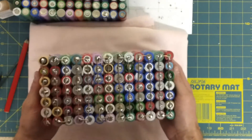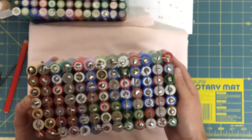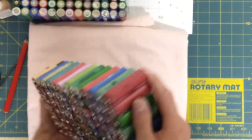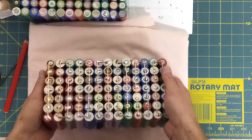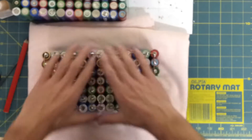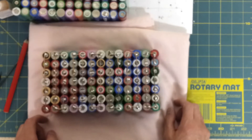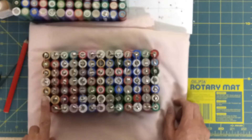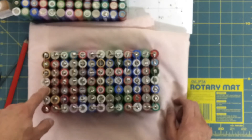That's the soldering job I've done on it there. Not neat, but it is functional. They're all connected well — I've tested them all. And the pack seems to be physically holding together fairly well. No doubt the extra bars here help to keep it together, so it's reasonably strong. I'm going to need to protect it with something that does not conduct electricity — maybe some decent plastic or something over here. And then I'm going to need some large wires coming off it for the positive and the negative. Something quite big, and I want them flexible, not rigid like these solid copper pipes here. That's a job for another day.